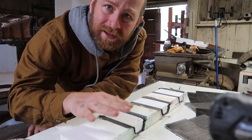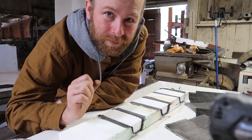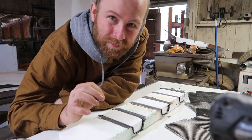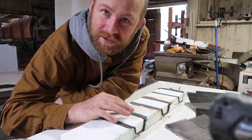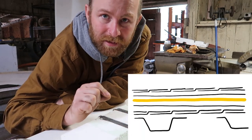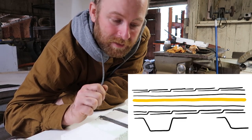I'm gonna go ahead and lay up the carbon fiber over the top, but I do have some news as to how I'm gonna lay it up. I've talked with my buddy Don Wygen again. He gave me some good insight on how to lay it up. So maybe I'll overlay some pictures and show you guys the first part of the laminate, the stringers or rings. On top of that, which will be the surface of the bike, will be two layers of 0/90 structural and then one layer of 45.